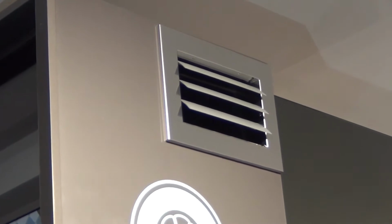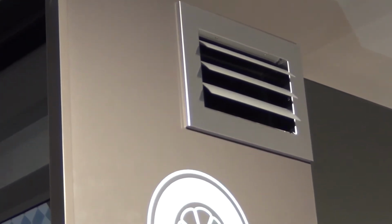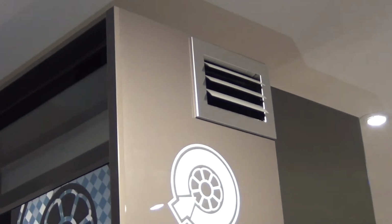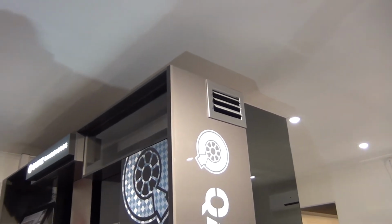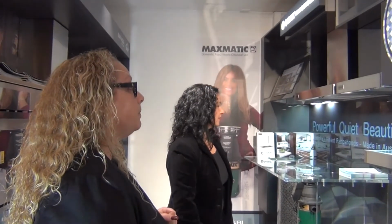So that's any with our backdraft wall vents or backdraft roof cowls. When the range hood's turned on, the shutters will open. And when you turn the range hood off, the shutters then close back down again. And for customers that are in a high wind area, we do have wall vent covers as well, which slide over the wall vent, which protects the wall vent from any wind and making any noise. Okay. Fantastic. Wow, so it's a matter of deciding which one you want.